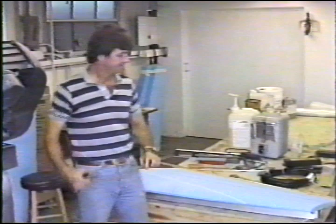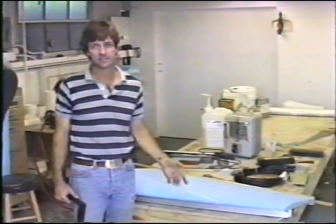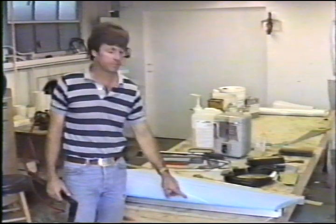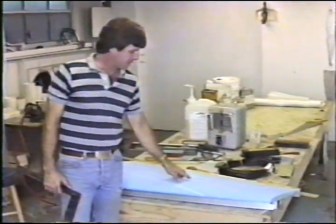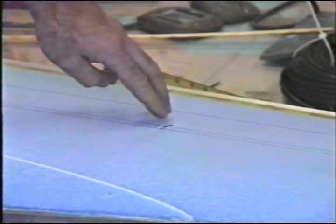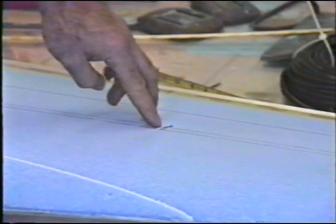Well, starting again, before we can go much further, we have to lay out our antennas. We'll bury a coaxial cable somewhere along the leading edge and lay out the foils on the upper surface. The foils are 20.3 inches long apiece and are set apart somewhere between 1/8 and 3/16 of an inch at their centers.